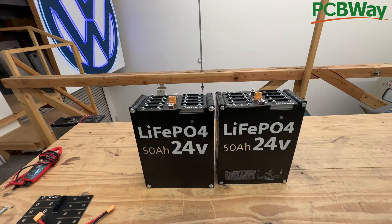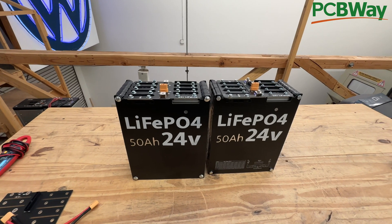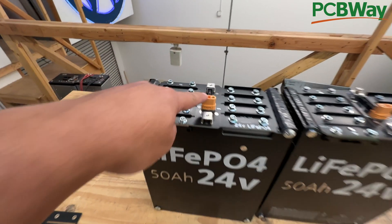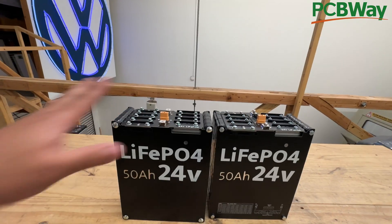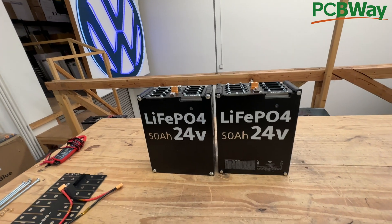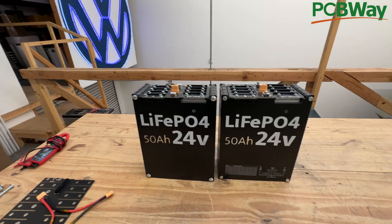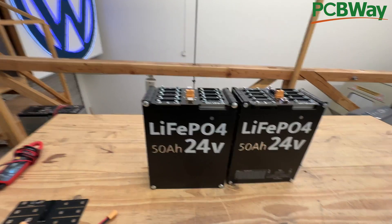This is how you do it — it's very simple. If your load is small, like about 50 amps or something like that, then what you can do is use the XT90 connectors included here. We've included those as standard because a lot of people are just powering something small — a little inverter, something that is 50 amps or less — then you could use that.